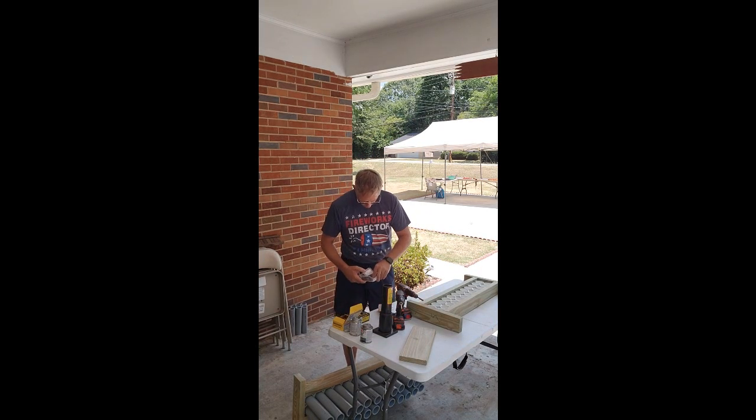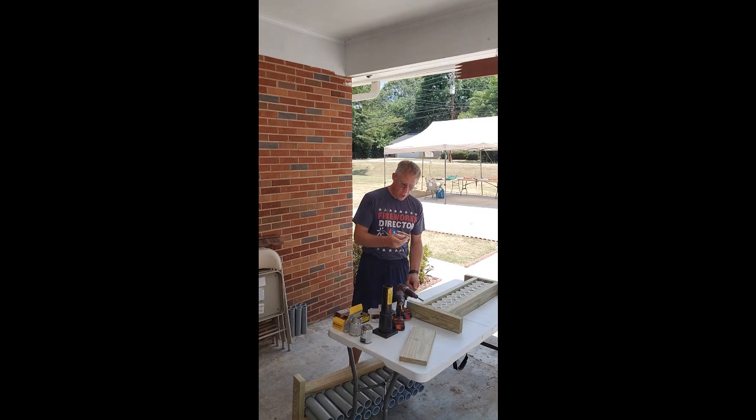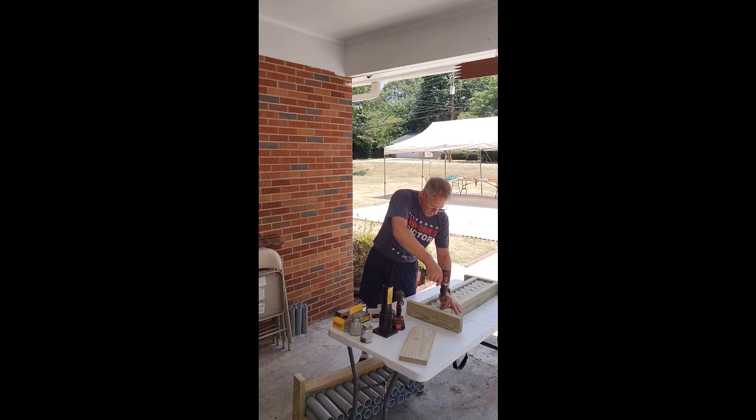And then we have here, these are 1 1/4 inch screws. These also have the drill cut, so they have a slice here at the end to be able to drill, as well as being self-drilling screws. But they also have a large head at the top of the screw to make sure that they don't just go through the PVC. So that's got a large head on the screw to be able to bite onto the PVC.